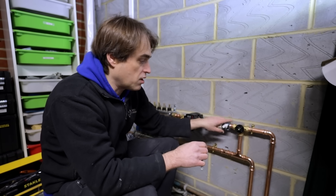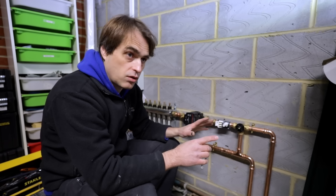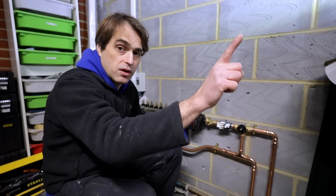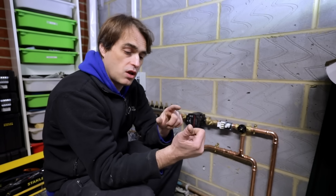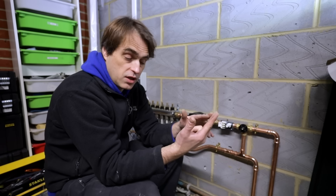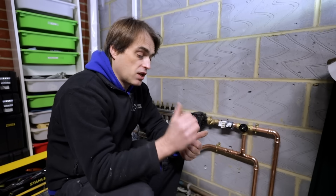We need that kind of protection. There'll also be a sensor on the flow to radiators and another sensor on the pipework here that links back to the boiler, so the boiler always knows what flow temperature it sends to underfloor heating, what flow temperature it sends to radiators, and another sensor inside the cylinder tells the boiler the temperature of the domestic hot water. So it's a much more sophisticated setup that allows not only greater efficiency and much greater control, but also much better comfort.